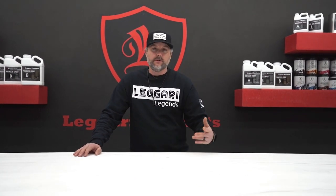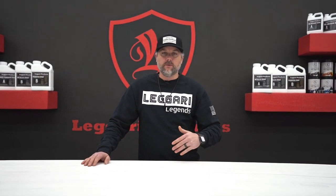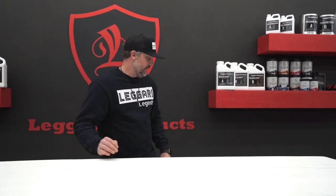Obviously, the tops are real simple, right? We can just buzz those flat, and we shouldn't even notice those repairs. Obviously, on the faces, we wanna be more careful, move a little slower, and always make sure we're using 220 grit or 320 grit. We wanna fine sandpaper. That way, we don't burn through the edges fast. And you'll notice I'll turn the sander on and off, turn it back on and off, just so it's kind of slowly sanding when I'm doing my faces. But I'll do the top real quick, and then I'll jump to the front edges.